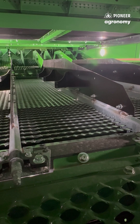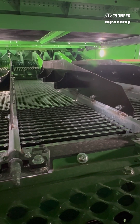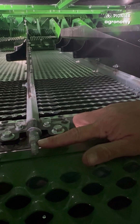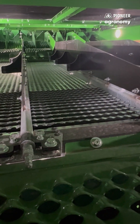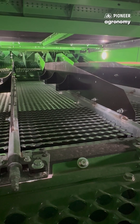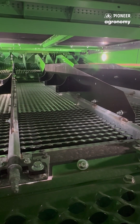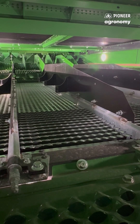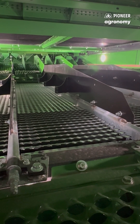We want to make sure that the dual zone chaffer is at a 5 millimeter gap standard — so make your manual adjustment at 5 millimeters. If you run the dual zone chaffer too open you will get excess tailings. If you run it too close you will lose a lot of excess grain off the back and right into the tailboard.